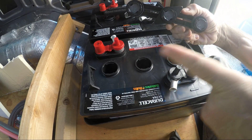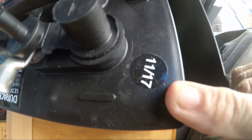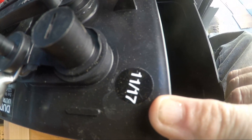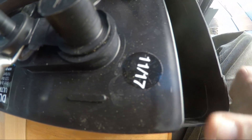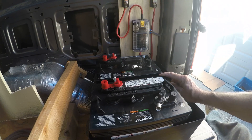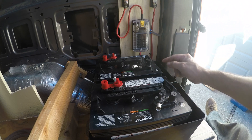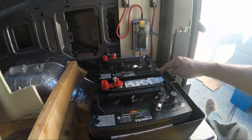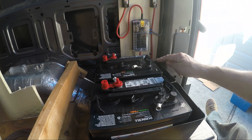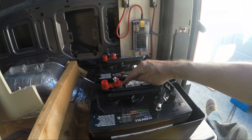Just verifying whether the water levels are right — this looks okay. I put them on November 30th, 2017, so they're brand new. These are two 6-volt batteries and I have to make a 12-volt system out of them, so I have to wire them in series — connecting the negative of one to the positive of the other.